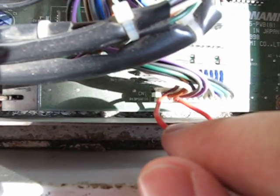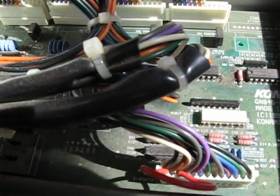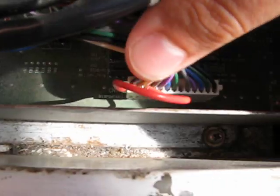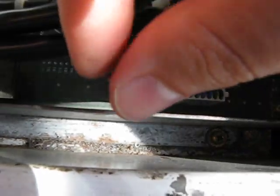The next thing you want to do after you push one end of the speaker wire into the black side is take the other end of the wire and push it into the white side. So, make sure that the white wire is pushed aside — just push it over — and then push the cord down into the white hole, into the hole where the white wire lies, just like you did for the black one.